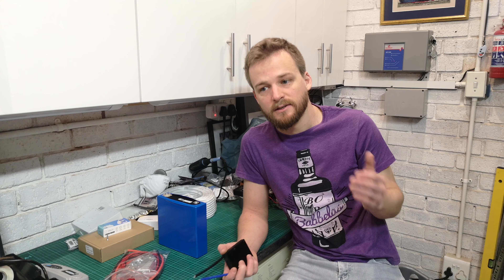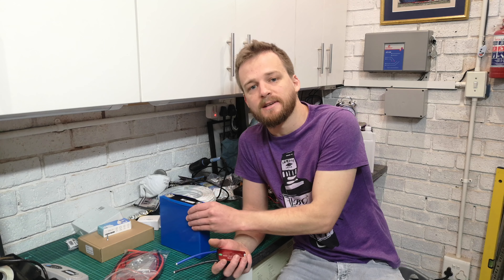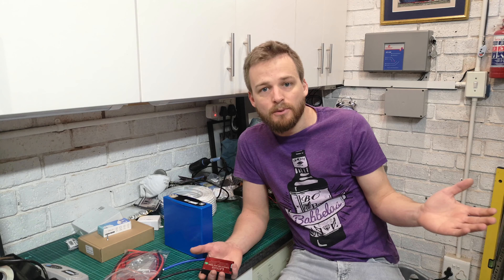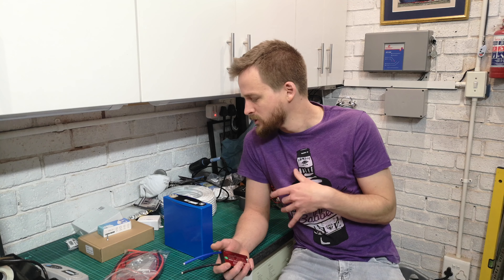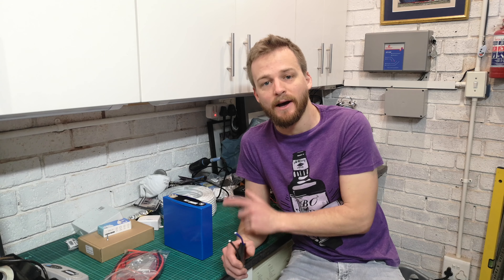A second-life battery like this has probably got a lifespan of around 2,000 cycles - that's 2,000 discharge-charge cycles, even partial discharge and recharge. That's more than six years, which is completely fine. And after those 2,000 cycles, this battery will still have 80% of its total capacity left. In terms of a normal use case, the expected lifespan of something like this is at least 10 years, even though it's a second-life battery. And that's why I chose these.